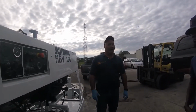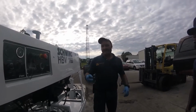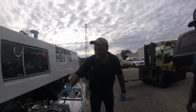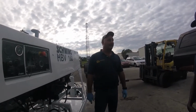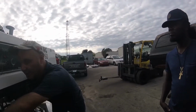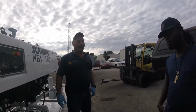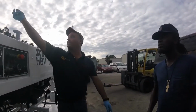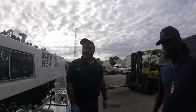Not actually, they do more than that. They run off the main driver pump too. So when you hit the switch, it dumps the hydraulic fluid right back in the tank immediately. So in theory, if you had your hand in there and the piston had run your hand, you could hit the e-stop and it stops it immediately. And it'll also cut the engine off. Right, there's 3 of them. 1, 2, and 3 on the other side of the hood here. Okay. You'll see it sticking out.